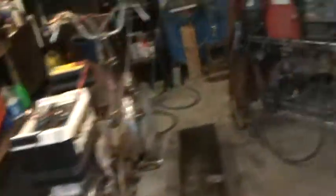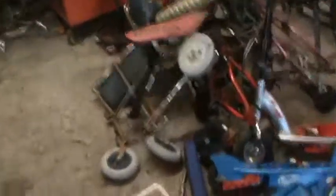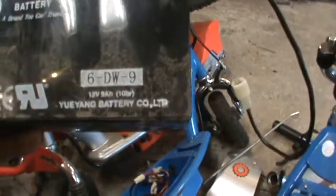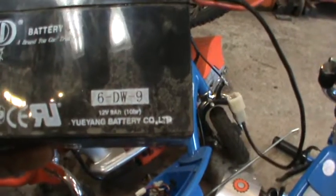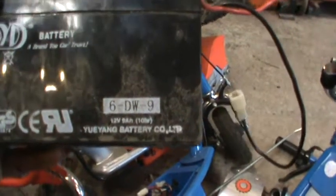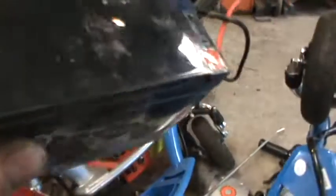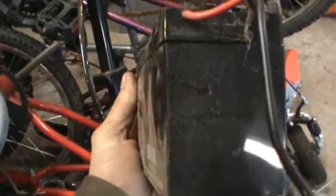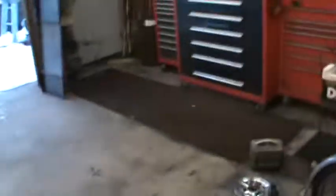These are only lead-acid batteries. Here are some larger ones that were in the 300 — these are totally shot. These are 9 amp-hour; the ones I ran were 3.5 amp-hour, 12-volt. You can see these guys are puffed out — they're no good. Anytime you see a battery with a bulge in it, forget it, it's done. It was discharged, it froze, and the water and the acid separated. It froze and cracked the plates. Forget it.